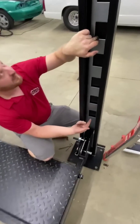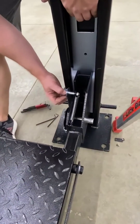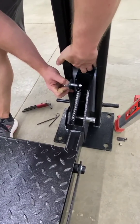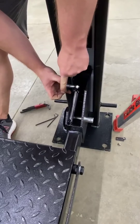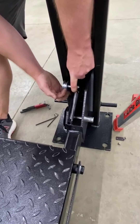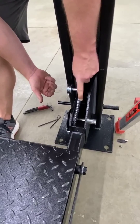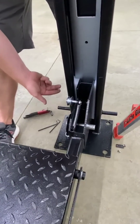So what you want to do — you'll see we've got the lock ladder we're starting to install here — you'll need to manually push this in, which will release that lock, and let the lock ladder slide down in. Make sure your cable goes up here on this side of the secondary lock, and that will keep it disengaged unless the cable were to fail. Then bring it into place and lock it in that position.